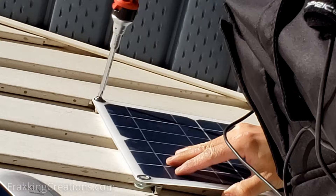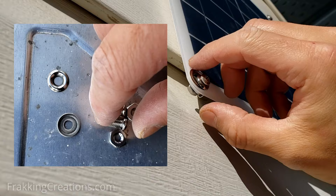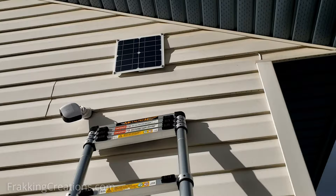The two bottom brackets and grommets should still line up. Lastly, attach and tighten the bottom brackets using the finishing washers, screws, and nuts. That's all to it — a very secure solar panel install that looks good and can be repositioned without much trouble.